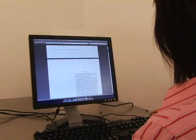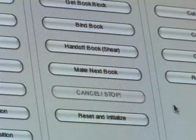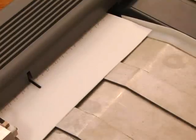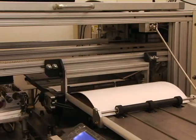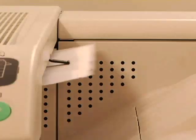The EBM uses pre-made files — the same files used in traditional book printing — a PDF for the book block and a PDF for the cover. Once in production, a four-color book cover is produced from tabloid or A3 cover stock, while a black-and-white laser printer prints the book's pages on standard letter or A4-sized paper.